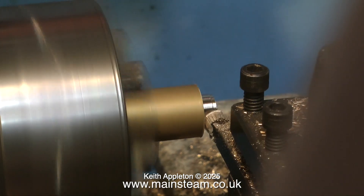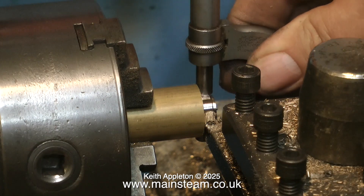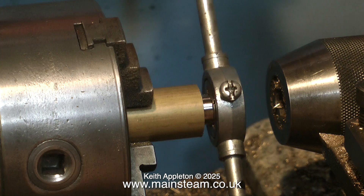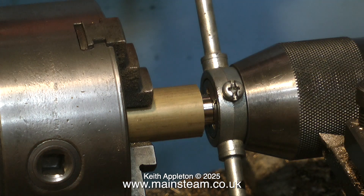That's nearly there — one more fine cut I think. Then the micrometer fits on like this. Not a good idea — do not leave micrometers clamped to the work. I'm aiming this next bit at people who do not have too much professional engineering equipment at hand. This is just an ordinary cheap die holder — you get these in sets.